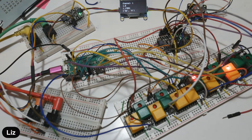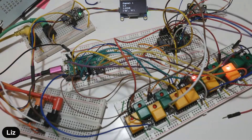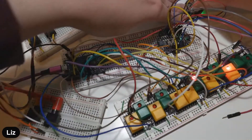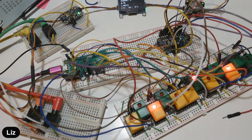There's some stuff in the code that basically maps the voltage to the nearest voltages that match notes, and then that's averaged through the DAC and goes out. Right now I've got functionality so that these keys can determine what notes are turned on, and there are two separate channels. If I turn the rotary encoder, you'll see different lights light up and different notes are noted there. I have it going out to two oscillators that I'll turn up so you can hear.